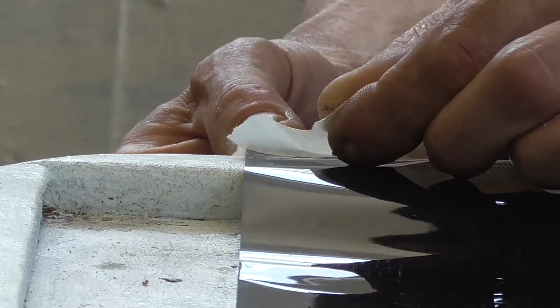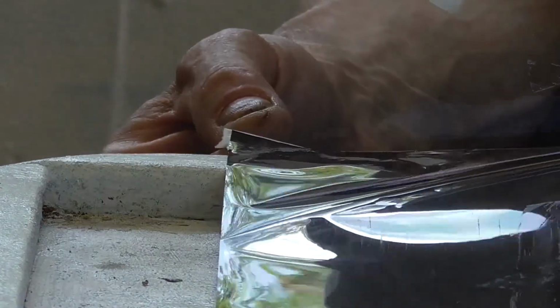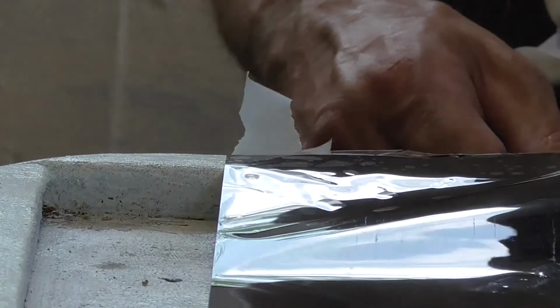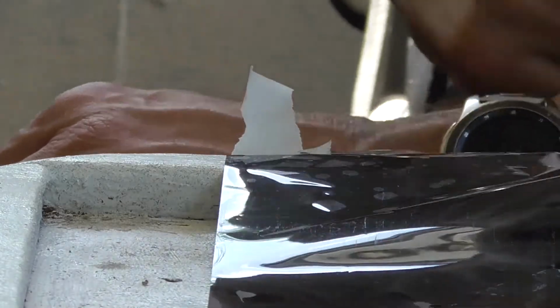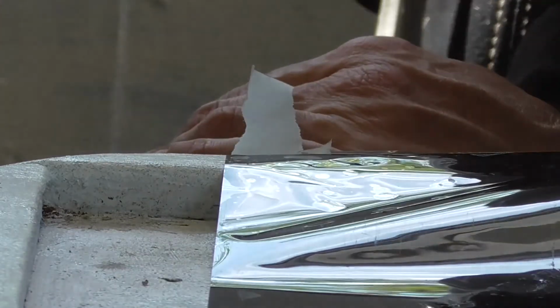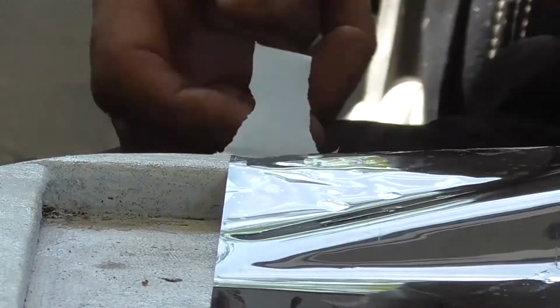But when you peel, that side will give up the clear film. So this is the side that's going up on the window, the clear film side, so we want to be careful with that. We want to keep as much dust and scrap out as possible. Get this off carefully in one piece, which is hard on your own, but I did a couple of cars on certain windows with it, so the back of my Volvo looked lovely. So the trick now is to peel this, spray it down, get the window sprayed up, lube the pair, and place it on. So let me zoom the camera back out.